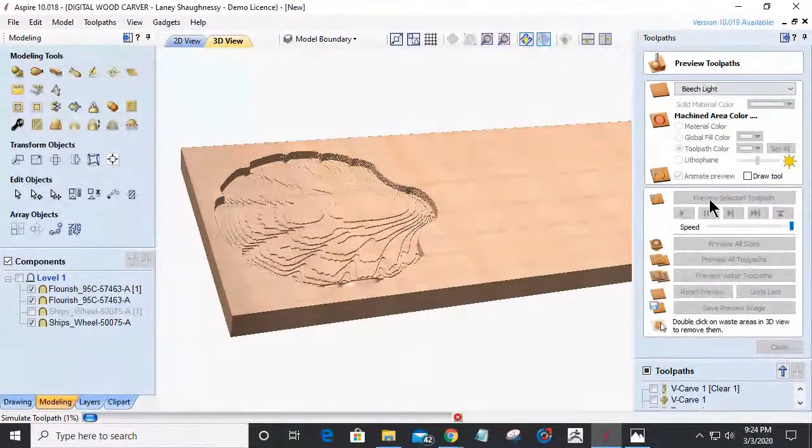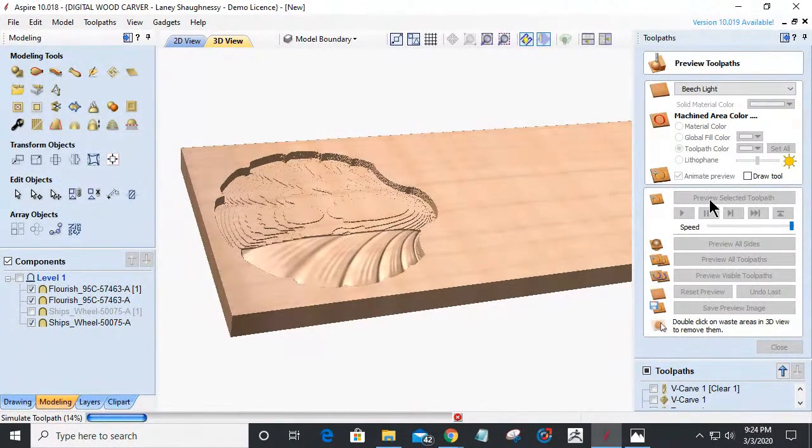We take our text, offset it outward. That's going to be the female pocket. It's going to be reversed, put a border around it. It'll also be the male inlay. Take that same original text and offset it inward, and that's going to be the text that's V-carved. And you would usually paint that a color or gild it, gold leaf it, faux gold leaf it. And it creates that contrasting color.